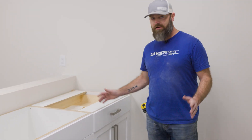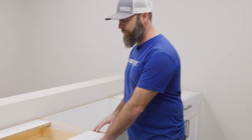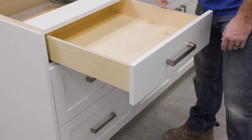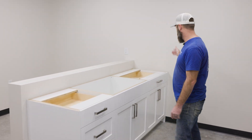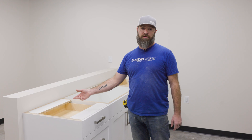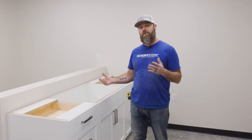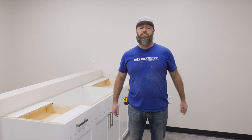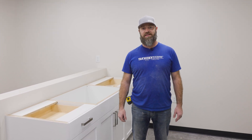We got the last bumper on — everything turned out great, really happy with it. I think the client's going to love it; it's exactly what they asked for. We got the melamine boxes as you saw us assemble them, Baltic birch dovetail drawers, and of course the MDF with the shaker doors, our outside panel, and the scribe on the end. One big benefit of having the CNC: it drilled all the holes for the hardware — the slides, the handles, the hinges — everything's done, which makes putting everything together a lot quicker and easier. If you want to see more like this, subscribe to our YouTube channel, check us out at shopsaver.com, and follow us on Facebook and Instagram. Thanks for watching.